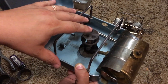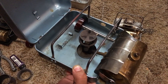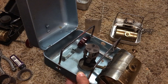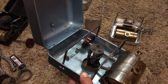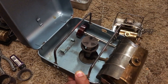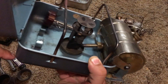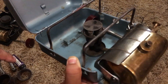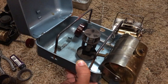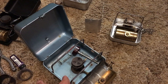That works the same on the B and the basic 111 model. The difference is that because this one is designed for kerosene, it has to have more tubes — more surface area for the fuel. But with white gas and the 111B, the B stands for benzene, which is basically the Swedish word for gasoline. So the 111B has two tubes, not four. If you look, this has four tubes and the one in the listing only has two — and that is really how you can determine that that is a 111B burner.